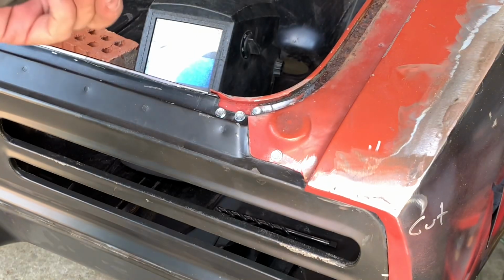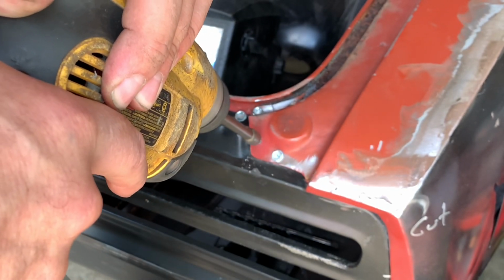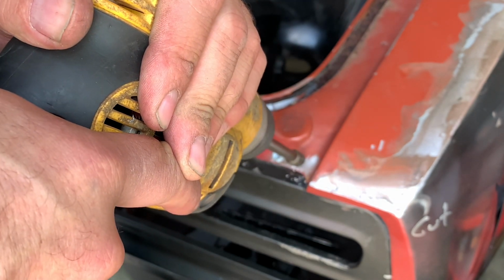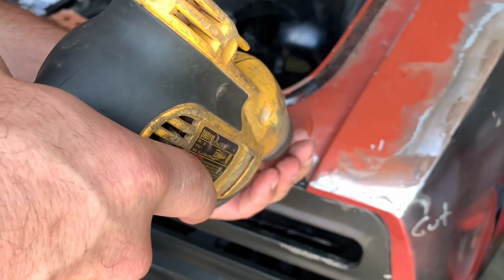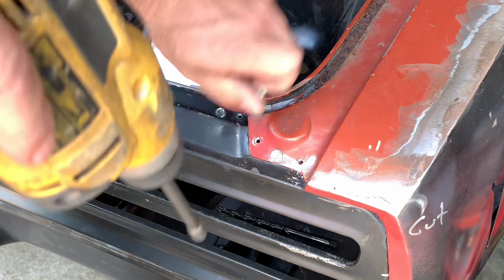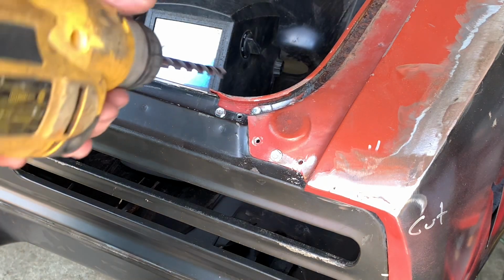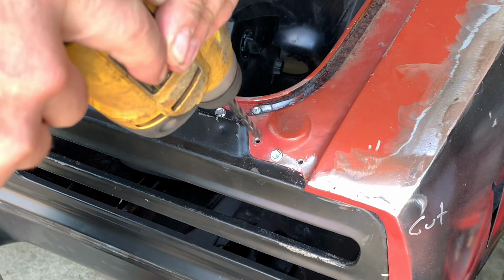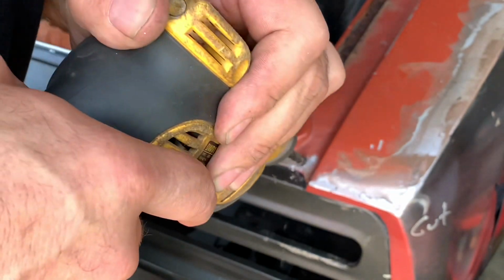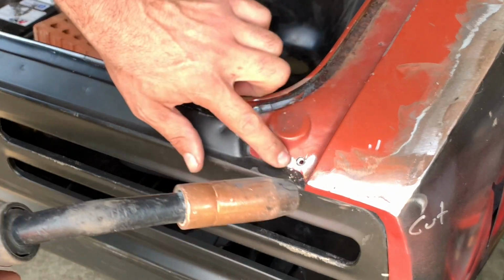Well, you just go right there. I say normal fashion, remove every other screw. Change to the drill bit. Now basically you just drill through the top layer, so there's only 2 layers here. And then we'll go ahead and weld those all solid.